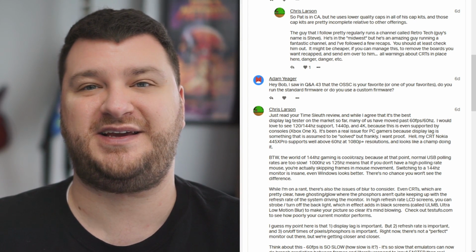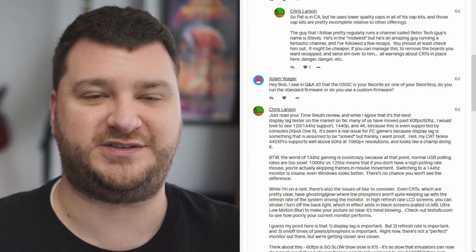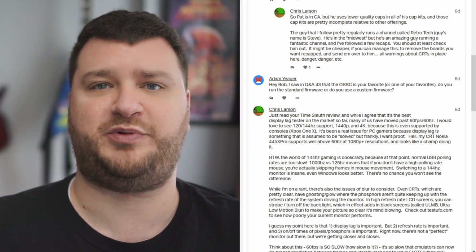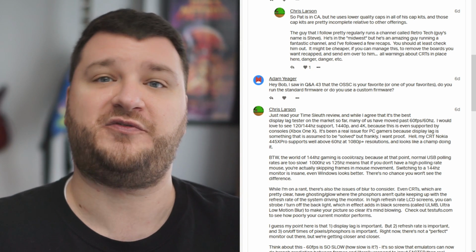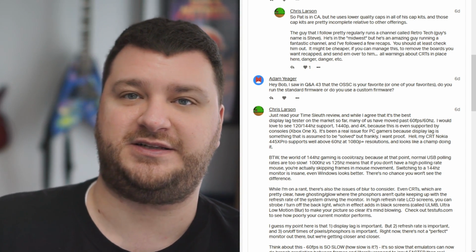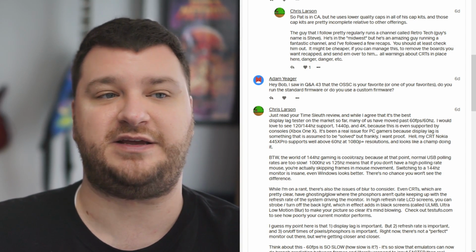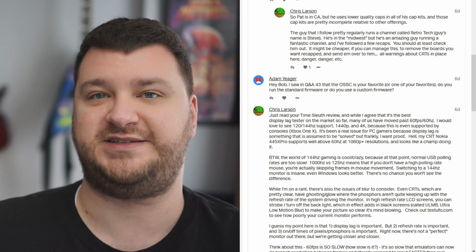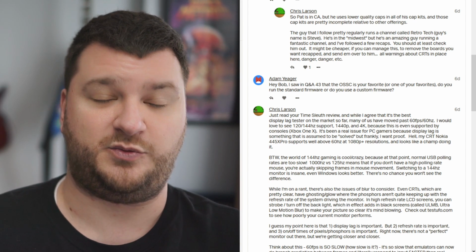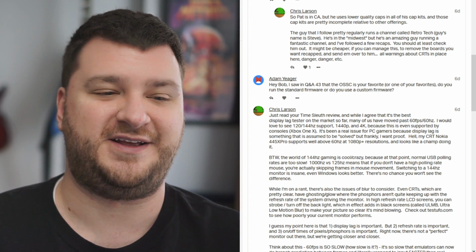But as with anything in the expert realm of retro gaming, the more you learn, the more you have to learn. So now every time, rather than use generic mode, which always looked fine, some people complained about the way it looked, the Perfectionist did, but it was good enough for gaming. But now every time I fire up a console, I go into the menu, I select Firebrand X's settings, then I go in, and because I almost never use the same console twice, even my stationary setup barely gets used. I'm mostly doing testing. So with each console, I go in and I set the phase and I set the sync filtering on it.